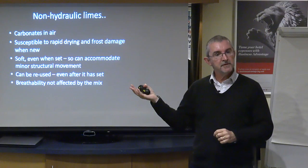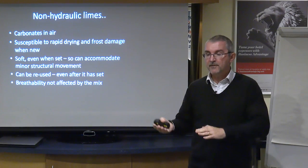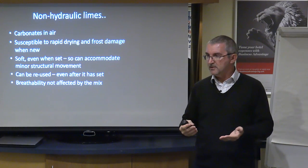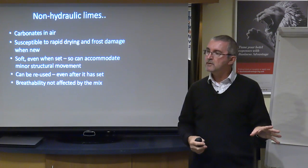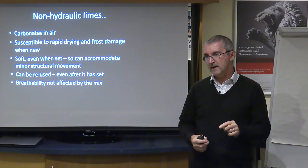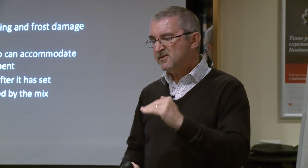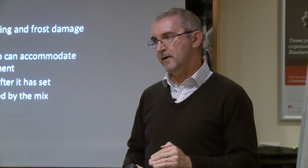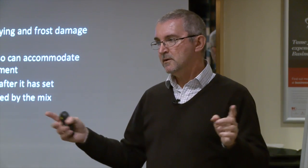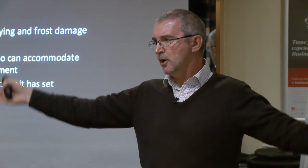You might have a nice sunny day during the day, and when you're advising your contractors on site or your client, it can sometimes be tricky to explain to your client, well, it's a beautiful sunny day, but no, they can't work today. And the reason is because it's not the daytime temperature, it's the overnight air temperature which is the critical factor. And when the overnight air temperature drops certainly below 10, definitely below 5 degrees Celsius, you're at serious risk of damaging the lime mortar. The first 90 days of that lime mortar set are critical to its entire lifespan.